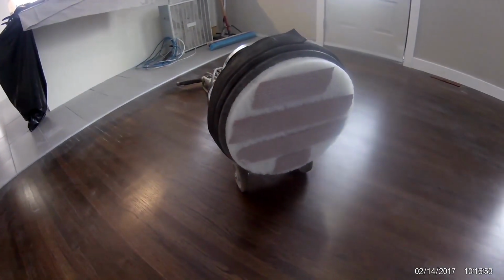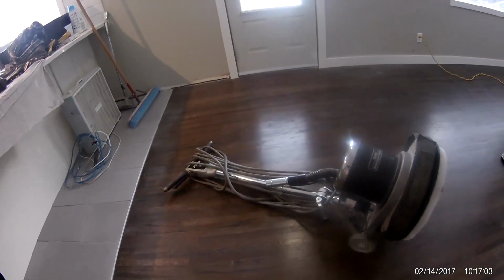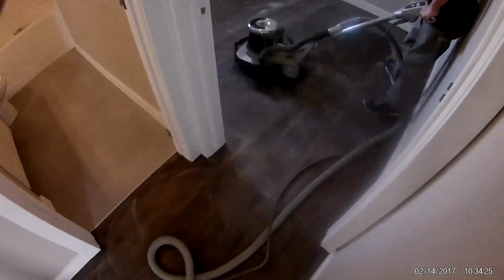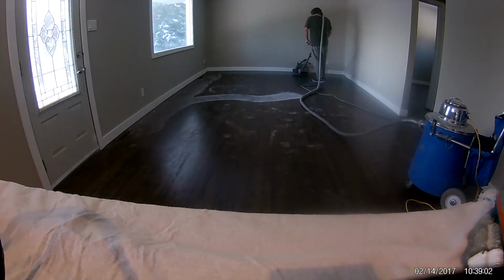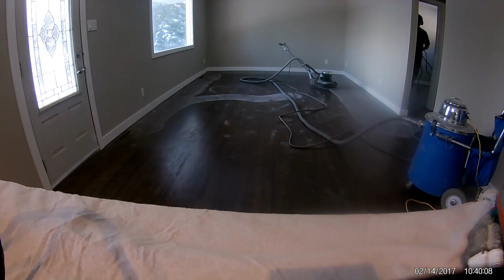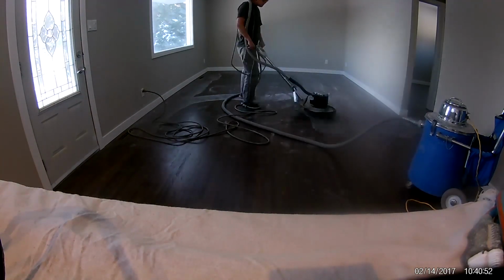Now that your finish is dry, I've taped some sandpaper to my orbital polishing machine, and I'm just going to take the surface layer off of the finish so that I can bond the next layer on. The process also takes care of the little tiny imperfections in the first coat of sealer. If you don't have this large floor sander, I'm sure that an orbital sander would do the same job. It would just take a little longer.